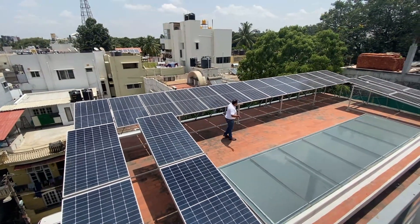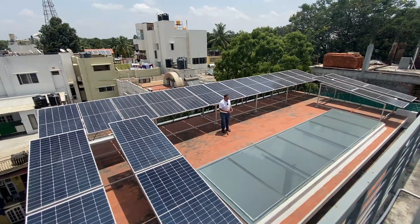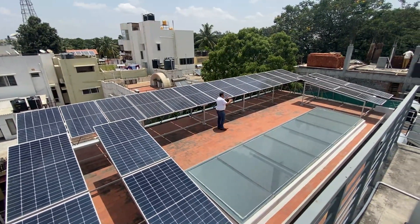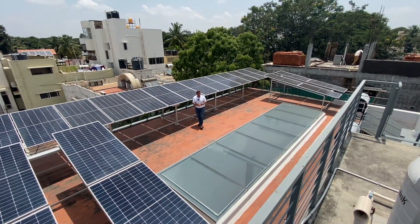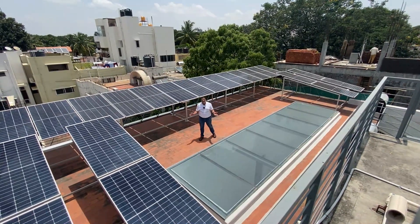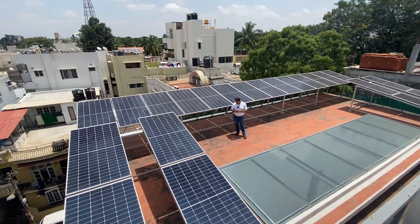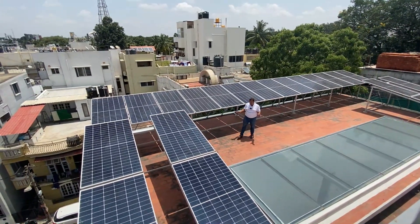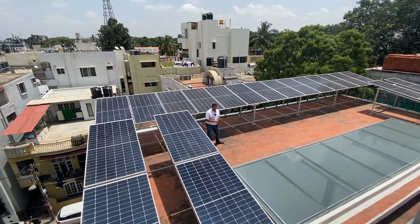This is the roof layout and as you can see, this is not a very tall structure. However, it is designed in such a way that there are no shadow issues, and the skylight is getting enough light. Like most of our structures, this is non-invasive — we have not grouted or done any anchorage on the roof so that waterproofing is maintained well.